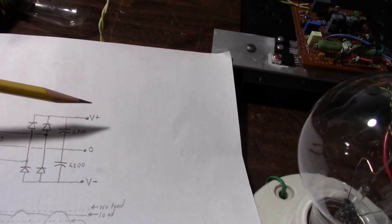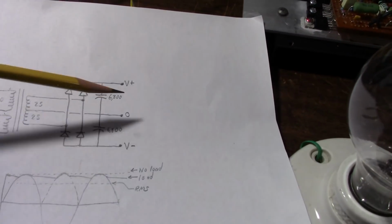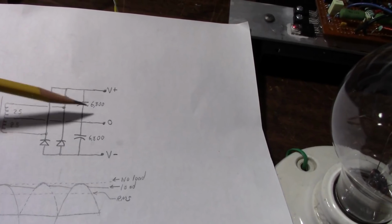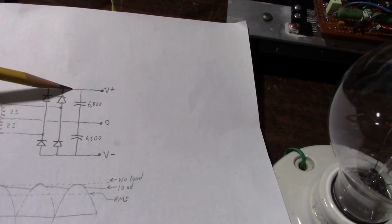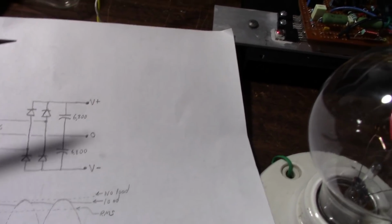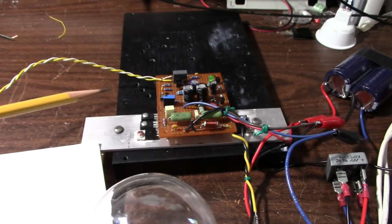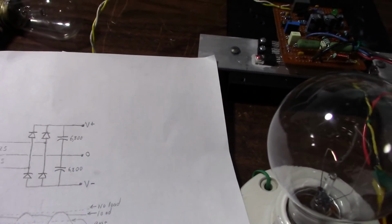The reason for that is if there's an oscillation or something, it gives an opportunity for the fuses to protect the amplifier from having heavy current dumped from these main filters. If you put it before the filters, then there would be no protection from that. As they say, it's the transistors that end up protecting the fuses, but you know, with good quality transistors, the fuses should protect the amplifier.